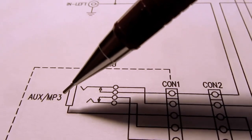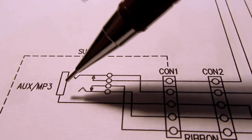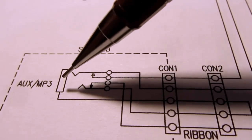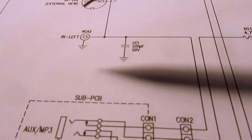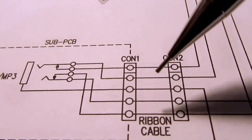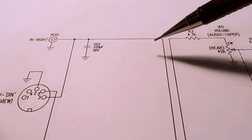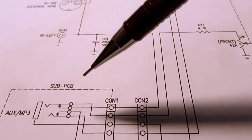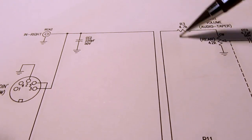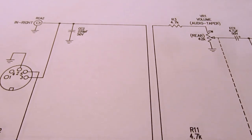Whereas if you're plugging in the output of an MP3 player, you probably have a short little cable, just 2 or 3 feet long in many cases, plus the output circuitry on a headphone amp tends to be lower impedance than the output of a typical line level device. So it might drive the signals a little more assertively, if you will. Anyway, they may have decided they didn't really need these high-frequency shunt capacitors after the aux input switching, and they really only wanted them here, or it could just be they messed up on the circuit board and they really wanted these to be over here after this aux switch instead of in front of it. Not sure. I first thought it was a mistake, and then I thought, well, maybe it was deliberate.